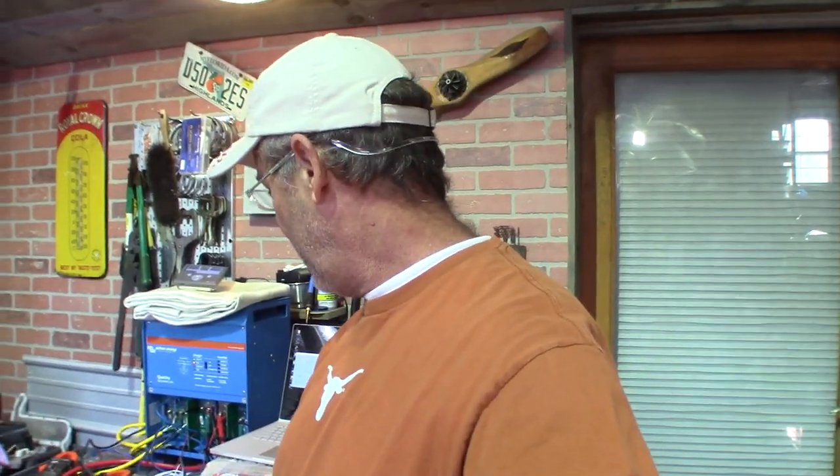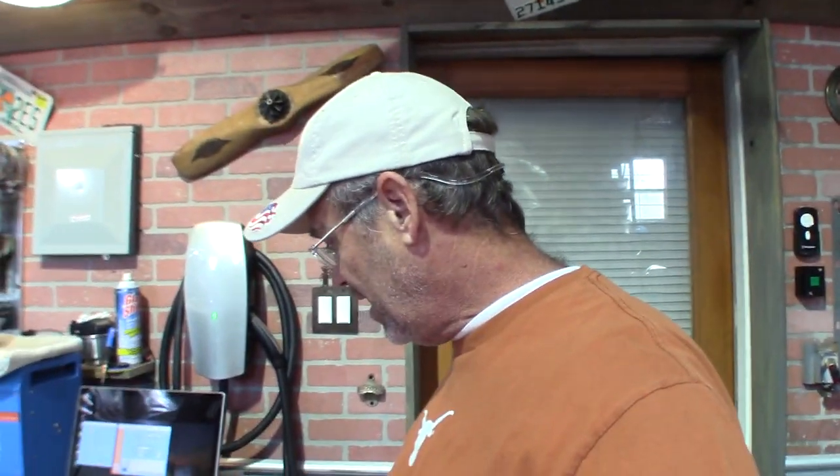Now you ask, why? Why would you possibly pull out your leaf system that's working perfectly fine? Well, I'll tell you, because I can. I am stepping down from 60 volts to 24 volts, going from a 14S to a 6S battery, so that I can possibly get more amp hours. Now, for you guys that look at things in amp hours, which I know a lot of boaters do, each one of these is capable of 255 amp hours. So total, I'll have just over 1,000 amp hours at 24 volts.